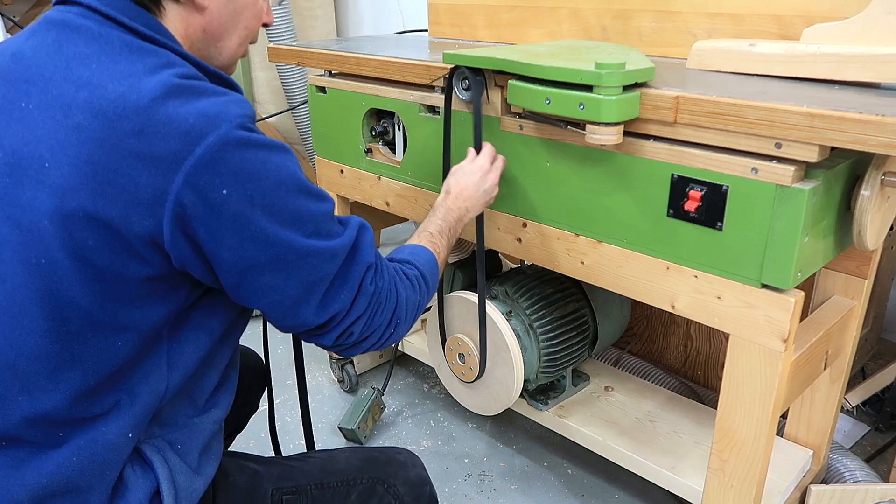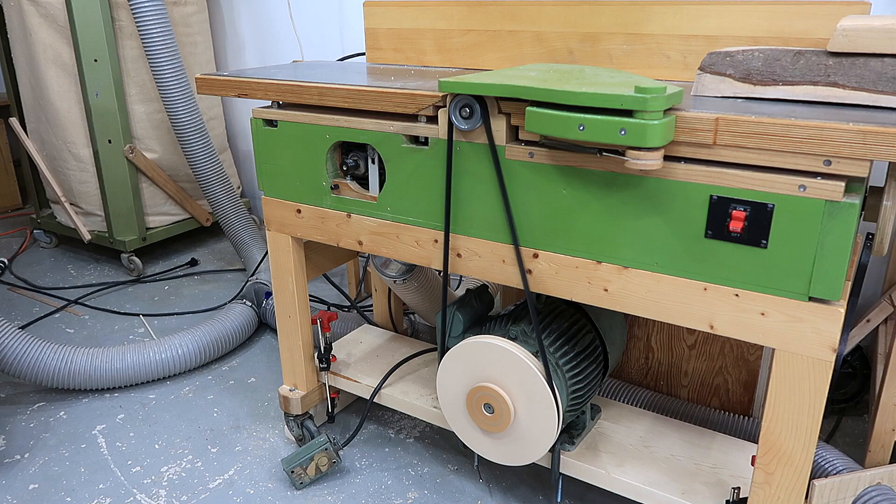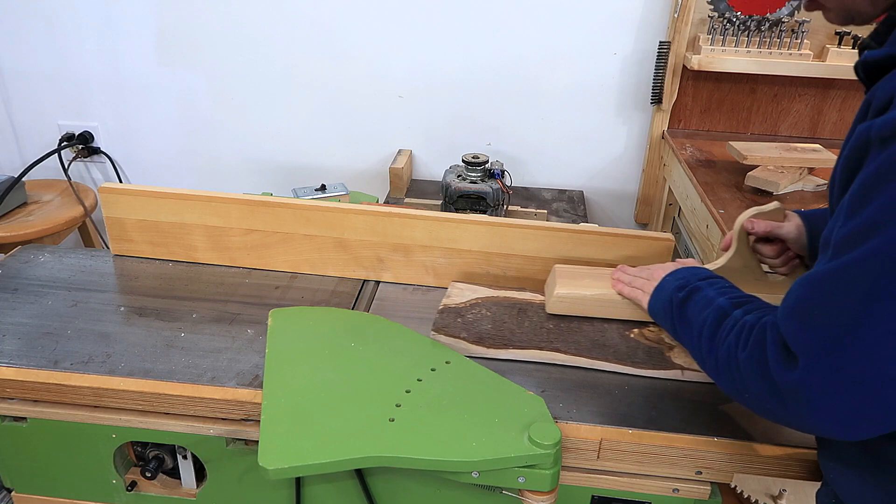With that huge pulley, that belt is just way too short, and I can't move the motor up far enough to compensate. So I ordered a new belt off Amazon, and it took much longer to arrive than they said it would - two whole weeks. I'm still getting squeaky noises off the belt. I think I need to tip that motor this way a little bit.